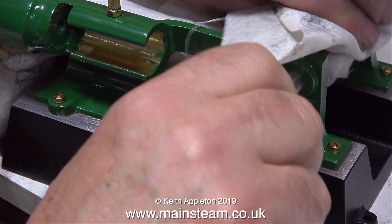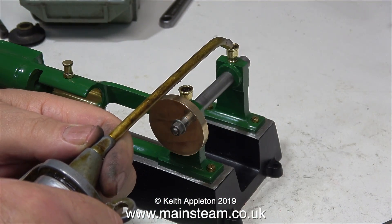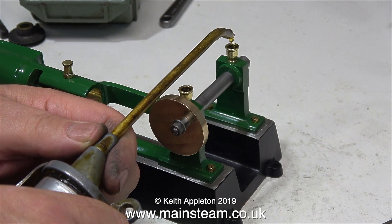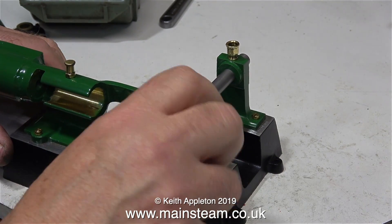I'm feeling slightly more pressure as it goes through. As the reamer is slightly sharper, I'm now using a cloth. After a while, it's time to refit the crankshaft and apply some more oil and see what it feels like this time. When I start to test run this engine once it's all together, I'll put a lot more oil in the oil cups, but for now one drop will be fine.